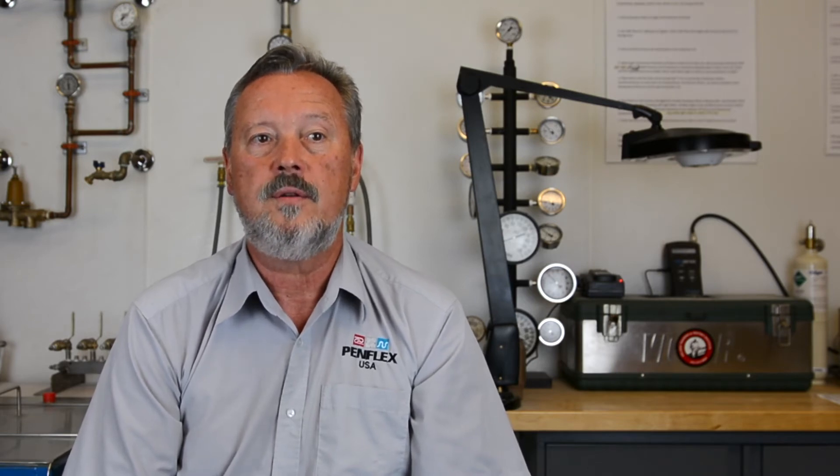This method enables us to identify common discontinuities in welded areas of the metal hoses being tested. We first apply a liquid fluorescent UV Zyglo penetrant to the surface area around the weld zone and follow procedure hold times so that the penetrant has a chance to enter the discontinuities.